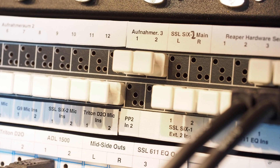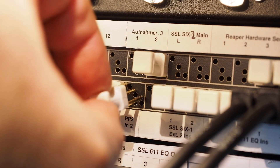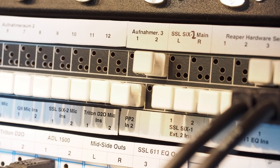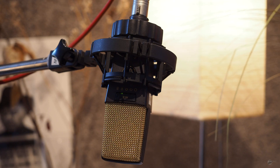Let me show you how it's possible to even patch phantom power across a Kilmetti patch bay without any issues. I'm taking a NormaLink plug and plugging the signal coming from my AKG C414 condenser mic into the input of a phantom-powering device. The mic is immediately ready to use. As soon as I remove the NormaLink plug, phantom power is no longer provided to the mic, so it shuts down right away.